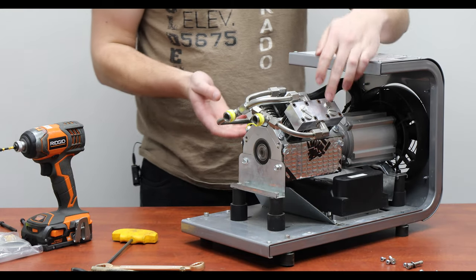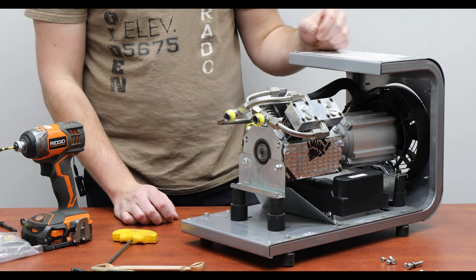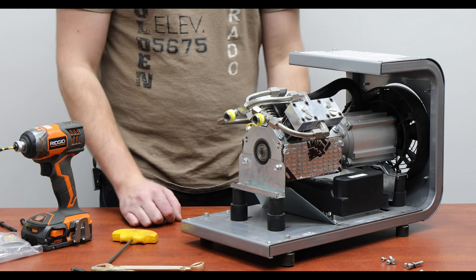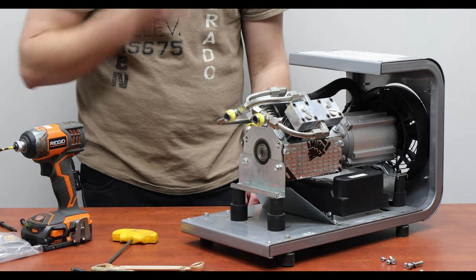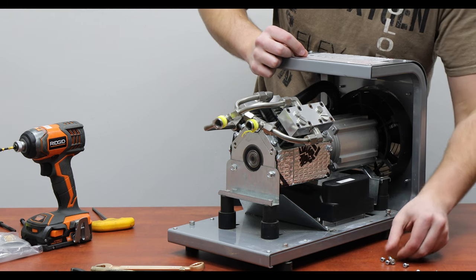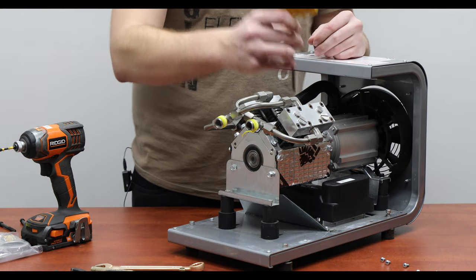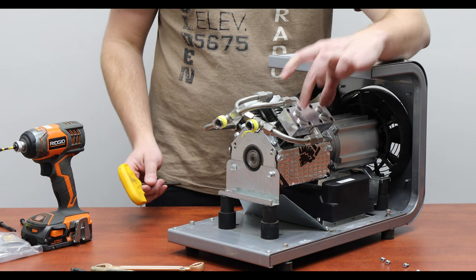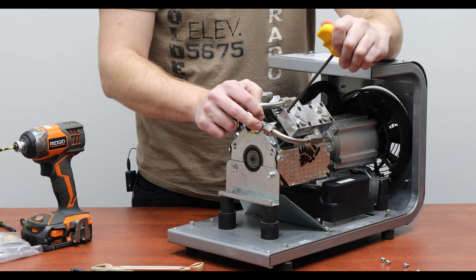Now you can see all the insides of the recovery pump. This sheeting is just to cover it from spills and also to prevent loud noises — it has a little bit of noise dampening built in. Next you can take off these pipes if you want to. You can clean inside the pipes as well, which is recommended if it's subjected to heavy use and a lot of resin. I'm going to put these bolts back in the legs just a few threads so I don't scratch the table. Now I have eight bolts in each cylinder head — two cylinders here and two over here, so 16 total bolts. Use your three-sixteenths Allen wrench again.